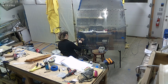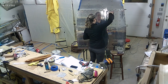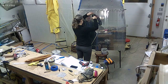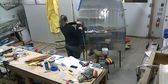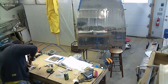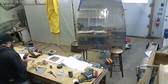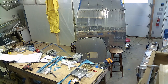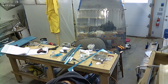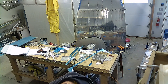One of the things I like doing with a big skin like this is you start in the middle and go outwards. You don't want to — because every time you're sort of stretching the skin a tiny little bit when you're pounding on it like this, the skin settles into place. So you want to make sure you don't put yourself in a corner where it got a little tight and you have to start reaming things to make them fit. So 90% of that skin got done there, we took a break for the night, and you're seeing me start work on the firewall right now.